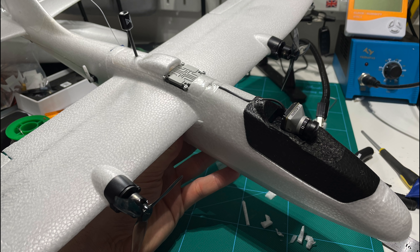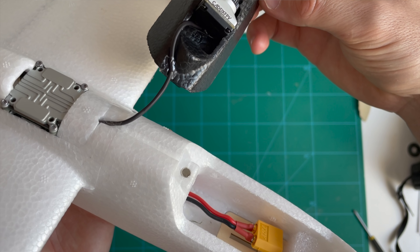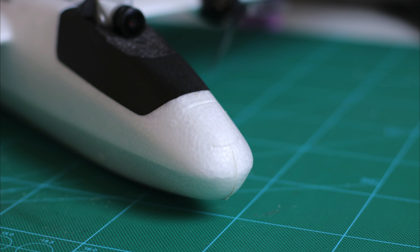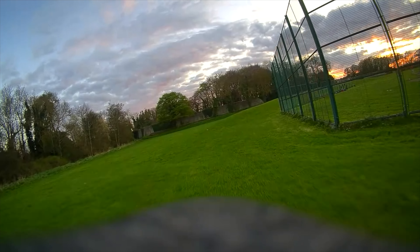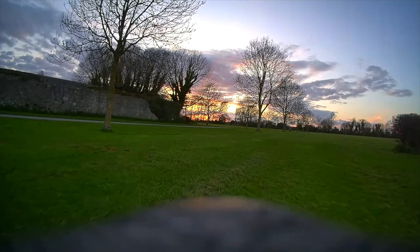Part of the plane is in shot as you'll see, but I can live with that. The top hatch that covers the analog VTX and the wing screws is a little loose for my liking, so I put tape over it to hold it in place — I taped both hatch pieces down after installing the Vista. The Vista itself is just a friction fit, wedged between the foam with no glue, and that's been absolutely fine for multiple flights including inverted flying. For wiring, I simply soldered power and ground cables straight from the Vista to the PCB so it gets direct power from the LiPo.